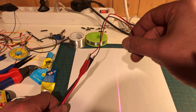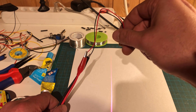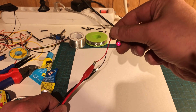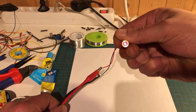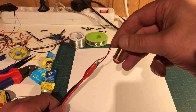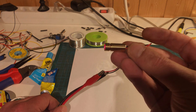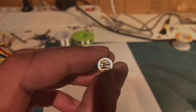I have already had a very good experience with the line laser as an illumination source. You can buy these 5mW lasers cheaply on eBay. They are usually operated with a voltage of 3 volts. There is a Fresnel lens at the exit aperture of the laser to create a line. The laser line is aligned at a 90 degree angle to the ribs of the Fresnel lens.